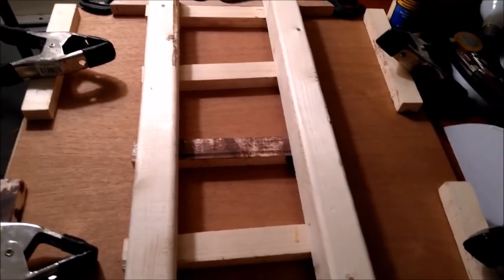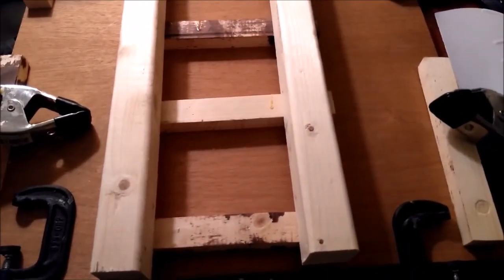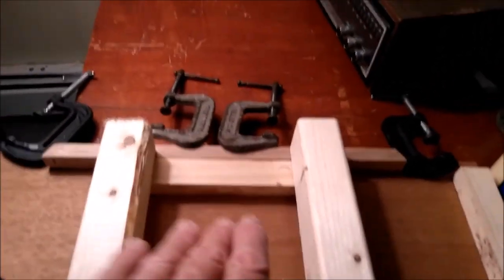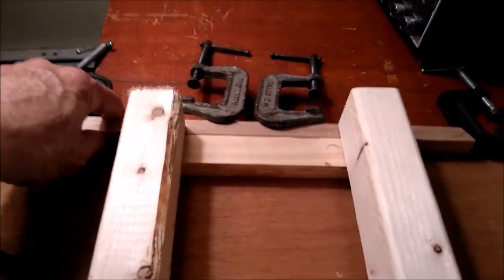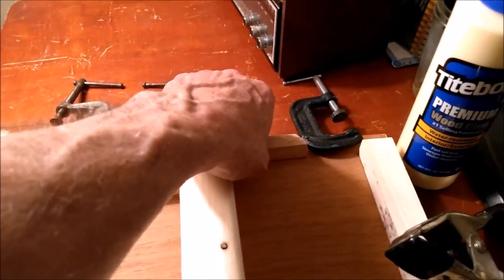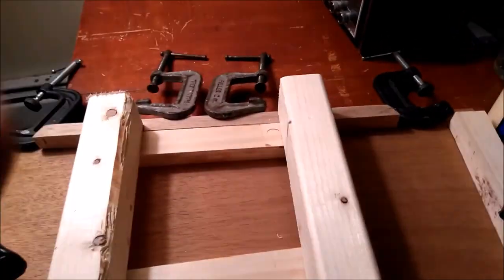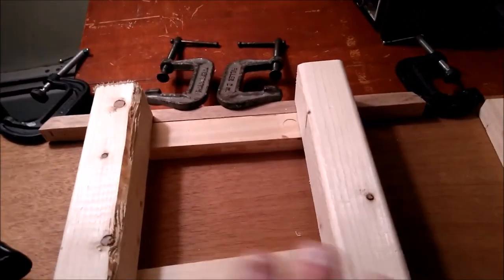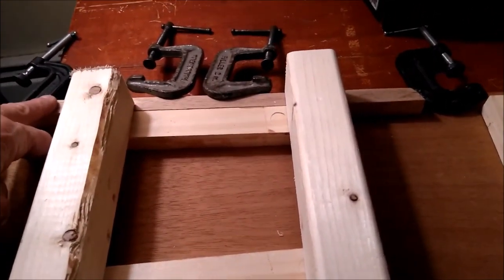The other thing I did was cut the plywood just barely wider than the mahogany, so that I can get all my clamps along the edges here, all the way up through. And I've got enough clamps. Down on this end, I've got a little bit of bowing going on with the plywood underneath. That's why there's this mahogany piece right here. It's a long, very straight, solid mahogany piece. I'm going to be using that to clamp the mahogany down onto. Actually, the whole idea is to pull the plywood up into the mahogany so that everything is nice and flat and level, and this will keep it flat and level because it's a good straight piece.